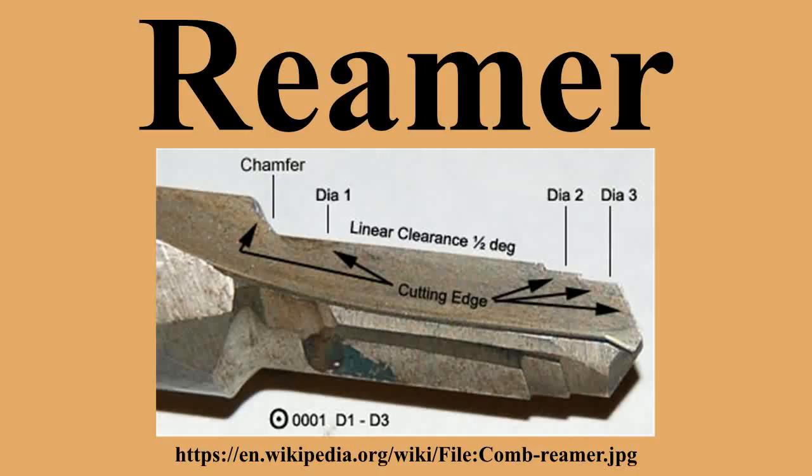To achieve highly accurate and consistent diameters with a reamer, one must consider process variables that can influence the overall quality of the hole being reamed. Variables such as reamer material, reamer design, material being reamed, temperature at the reamed surface, reamer speed, machine or operator movement, etc., must be addressed. By controlling these variables to the best extent possible, the reaming process can easily produce highly accurate and consistently sized holes. Reamers should not be reversed in use as this will tend to dull the cutting edges.